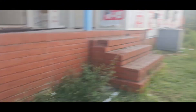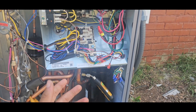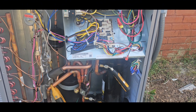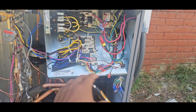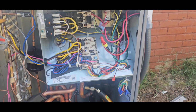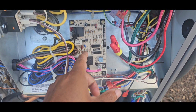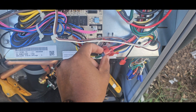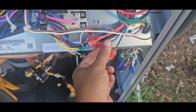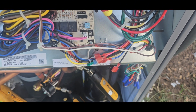We were trying to figure out the blower speed — whether we needed to raise or lower it on that one. Judging by the pressures on this unit before I started the camera, it's doing the exact same thing as that one, showing signs of low airflow. If you're ever working on these and you only see the defrost control board, your fan motor speed taps are going to be right here. Black is your cool speed. On this two-ton unit it comes from the factory on low speed, and the orange and pink are your medium-high and medium-low speeds.